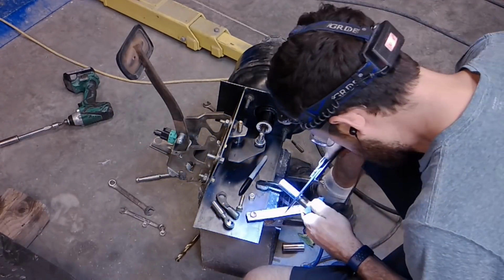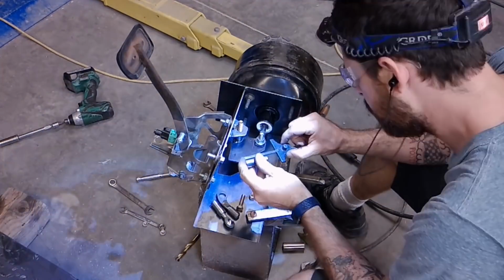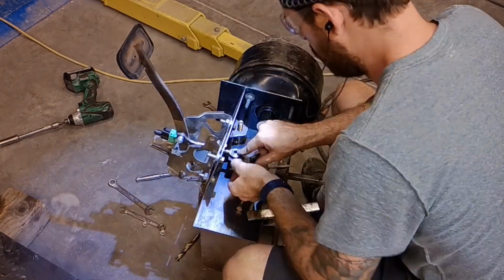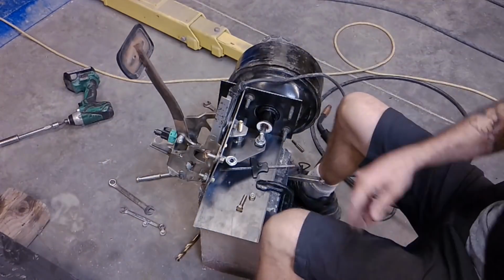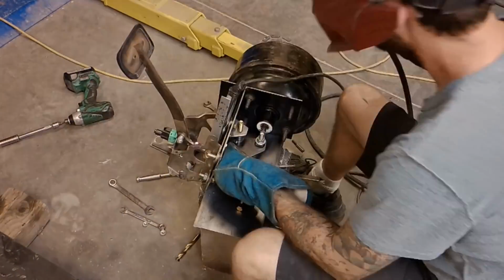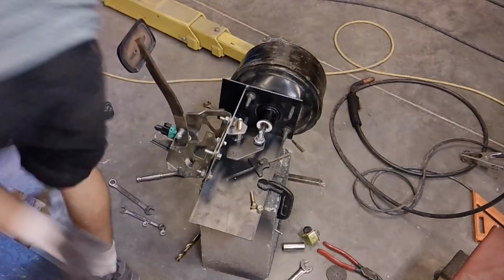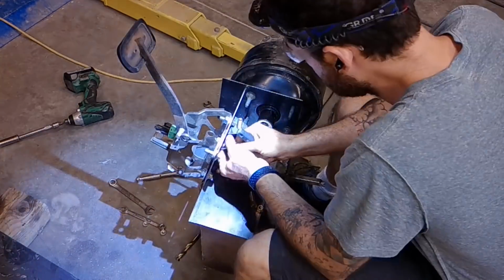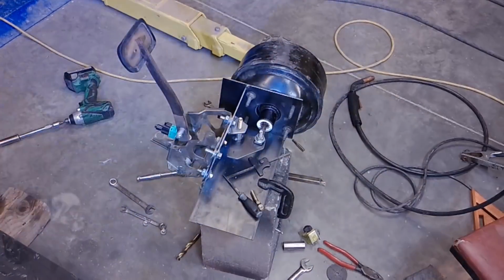And this is really where I mess up, because after all that measuring with the pedal partly depressed, I end up measuring it here with the pedal most of the way out. And so it ended up with that rod a little bit too long. And so I think, oh, no problem here, I'll just move the mounting location a little bit on that triangle, which ended up being the mistake. What I should have done was shorten that rod again so that I could use the triangle, because as the triangle moves, it actually deflects the rod a little bit inward. But I haven't figured that out yet, so I'm still just trying to get all the measurements just right.